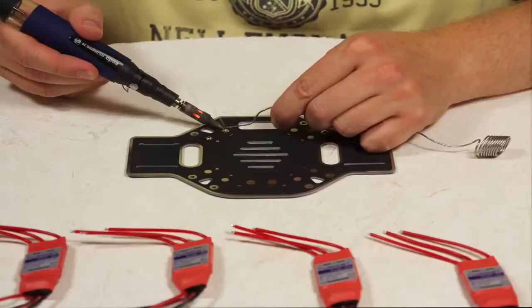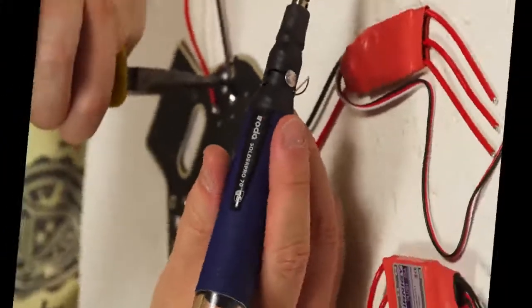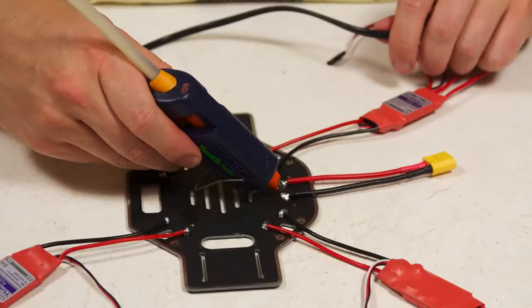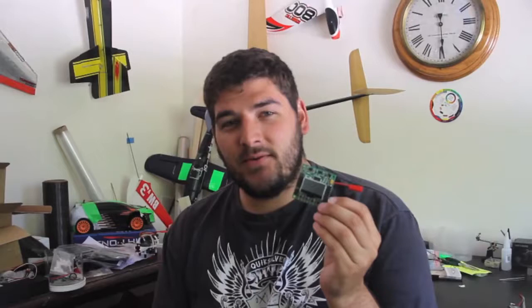The first step in this build is tinning the integrated PCB so that it is ready for the ESC power leads and your choice of battery connector. A good soldering iron is essential for this build — I used the Solder Pro 70, but any iron capable of 70 watts will be fine. Now that you've attached your ESC power leads and battery power lead, you can protect your bare joints with some hot glue. This will prevent a short out if anything conductive gets in there. I must add at this point that we forgot to attach the two thin wires that supply the KK board with its power monitoring feature. Fortunately, Don — or DHDS Racer as he's known on YouTube — has a fantastic video on how to attach the leads to the KK board and to your power system. The link for this will be in the description box.